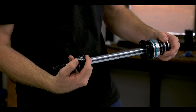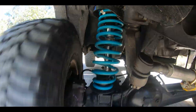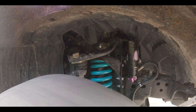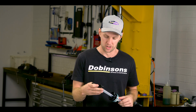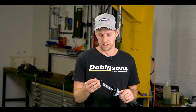Looking at the rebound adjuster, one of the critical things we looked at was shock travel. It's not too difficult to build a rebound adjusting device into the shock, but the critical thing is not sacrificing travel. The more travel we can get out of the same size shock absorber — without extending the bump stops or moving up shock towers — the better ride we can achieve. We can run a softer shock with more travel and that gives great results. Meeting that criteria was quite difficult, but we settled on a design for the rebound adjuster that works really nicely, gives a really good range of rebound adjustment with smooth increments, and critically it only lost two to three millimeters of shock travel compared to our normal MRR shocks.